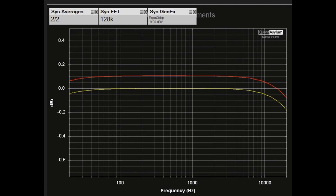This is a plot of the frequency response of the DH 500 putting out about 5 watts into 8-ohm loads, from 20 Hz to 20 kHz. The specification is plus or minus 0.5 dB flatness across that range, and we are definitely meeting that requirement — we're maybe down 0.2 dB at 20 kHz. The channels are pretty well balanced, within about 0.1 dB. Overall, this guy is performing admirably.